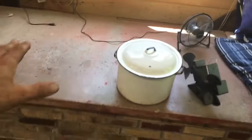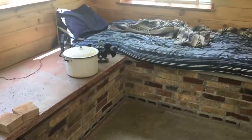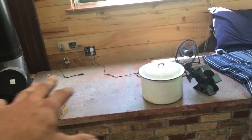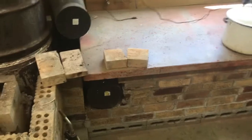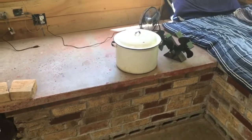Additionally, I have three temperature sensors in the concrete countertop — one right there, one in the corner under the bedroll, and one in the feet on the bedroll. I've seen as high as 187°F under the bedroll, which is quite toasty. Over the uncovered area the heat doesn't transfer well from the gravel into the countertop. When I cob it in, my plan is to do a loose slip at the very top and set the countertop on there so it squishes into it and makes direct contact — I think that will really improve performance. I hope it doesn't go hotter than 187°F right next to the manifold, but I'm sure the cob will retain heat much longer than the gravel does.